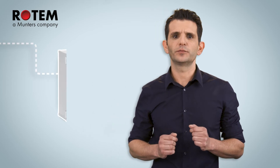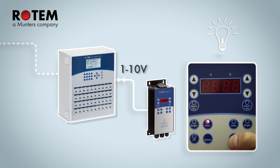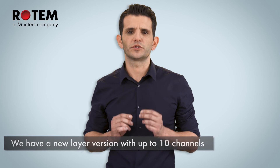The next step is to define how you want the RLED 2.0 to communicate with the controller. Press and hold the options button for three seconds and go to CH. Select 0, which means using 0 to 10 volt DC analog input. Or select 1 to 8, which is the number of connections channel. If you have a platinum controller, 4 is the highest number you can choose.